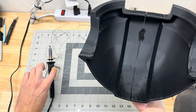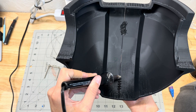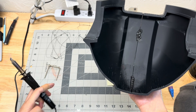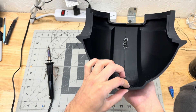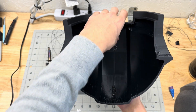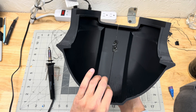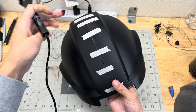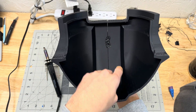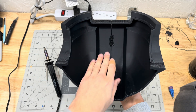This feels so smooth at the top here — I'm going to get that put together as soon as I can. Looks like I misaligned a little bit — push it back while it cools. It's nice and smooth on the top. What you want to make sure is that you have a very nice weld on the inside, something firm that's going to hold tight, because we're not doing that much on the outside. I have two tack points now holding this together, and I can go in and hit the whole rest of the seam.